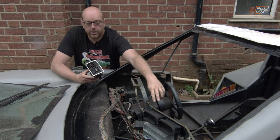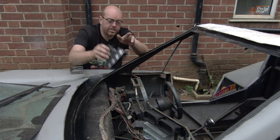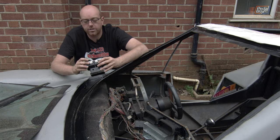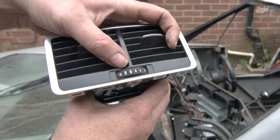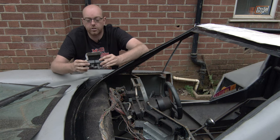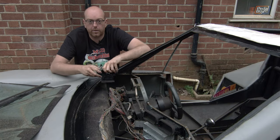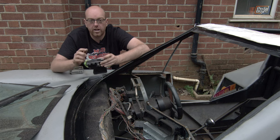What I decided to do was build up a surround for the extra vent we're going to add for the footwells. The heater has four outlets — two coming up here, one going into the windscreen vent we're making up, and this vent going just down here to do the floor vents. This is actually out the back of my old A6 — it was in the centre console and had two outlets coming either side for the rear passengers. It's perfect for what we need: it has two independent directable vent controls, so we can split air between the two footwells, and it also has a pair of butterfly valves on the back so you can close it off — which means we don't need to buy a separate vent closing valve for the heater box, so long as the little dial can be easily accessed.